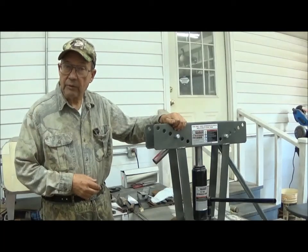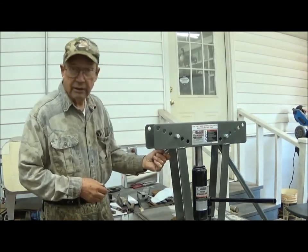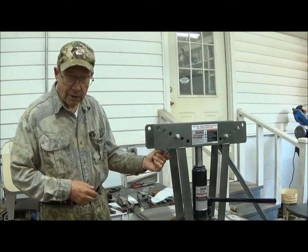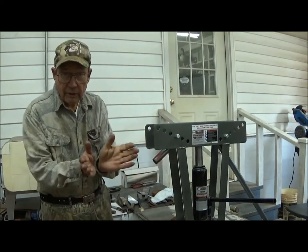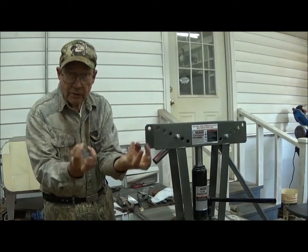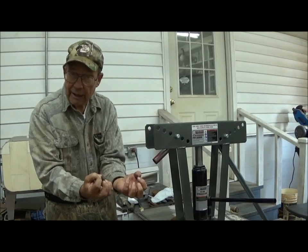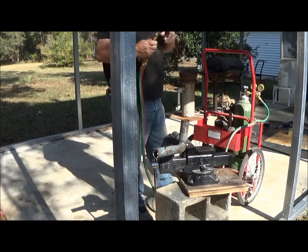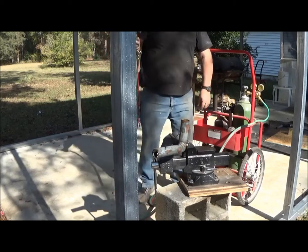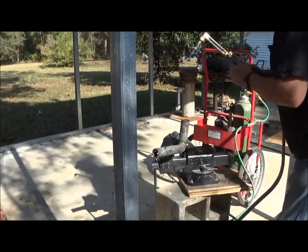In order to make the exhaust on the cabinet work, we're bending a piece of pipe. This is a piece of a tent awning that I had taken down and replaced. We had some pipe left over from the awning, and also a join that we're going to cut off, which will give us two ports at the bottom to catch the fibers coming off from our handle grinding right at the point of release at the ends of the wheel. We're getting prepared to cut that piece of angle so we'll have two vents to take the dust from the grinding stone. Paul is going to do that with the cutting torch, and then we'll cut the other longer piece that will actually feed out of the machine.